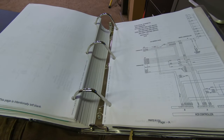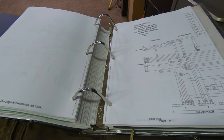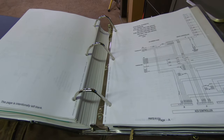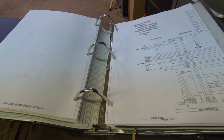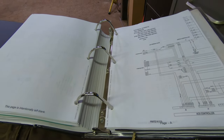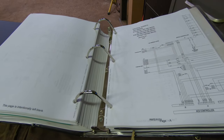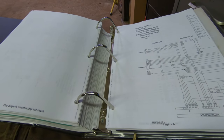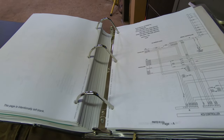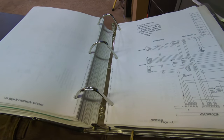If you turn the selector for the controls to H, it will only lift or only tilt back and forth. It won't lift because the lift has to be done on the left controller. I did have it work where it actually lifted on the left controller for a short amount of time, like a couple of minutes, but I didn't want to mess around with it and get the bar stuck in front of the door and get stuck in. But it worked for a short amount of time. And then it would throw other codes.